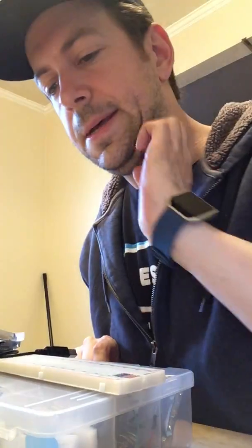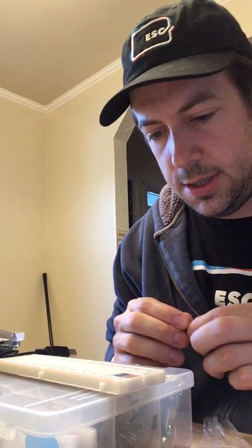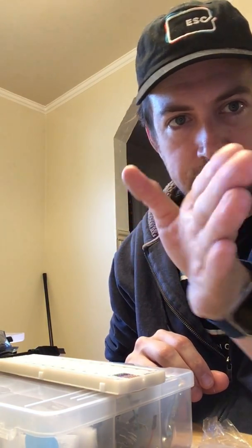There we go. And the wiring here is tricky because I am going to be working with a bunch of wires, because 8 LEDs, each one requires its own resistor. So I'm just going to start by putting the LEDs in first, and then I'm going to put the shift register in separately. Essentially all of the pathways are going to go through the shift register into the LEDs, into the resistors, and then back into the Arduino board. And the Arduino board only has 3 outputs that's going to be controlling all 8 of these LEDs.